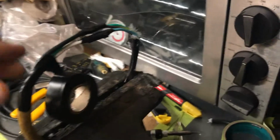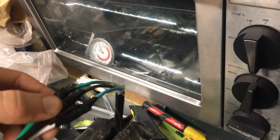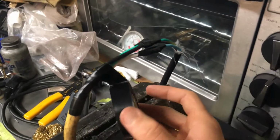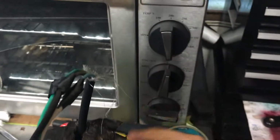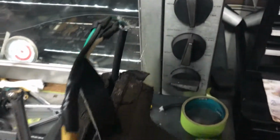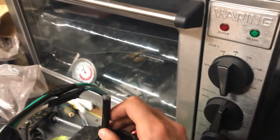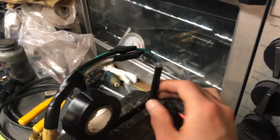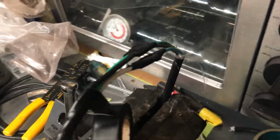Once we get all the solder back in place and tape over the individual connections so that we don't risk contacting the wires, if you do go the unfortunate route that I am going of using electrical tape, the final thing I like to do is do a pass over of this to keep all this stuff together and help add some strength in case this cable gets pulled on. But if you've made it this far, you're pretty much done. You just finish taping over it like this to make it look pretty and keep everything together, and you're done. So well done, and thanks for watching.